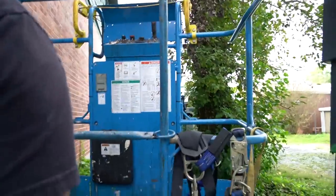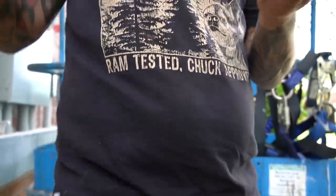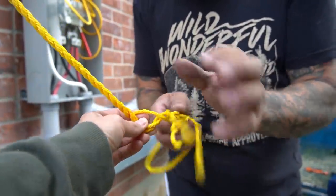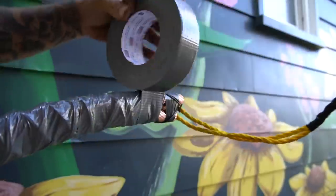On today's sketchy assignment, we try to pull a couple hundred pounds of wire from very high up all the way down here in a basket with a little tiny piece of rope. The sketchy thing is getting that lift next to that line — but it's not a high-voltage power line, so I'm safe. Round two. We're going to take all three of these legs, tie them and make a head, make it nice and neat and small. We're going to strip the insulation, make a tie-wire basket on it, tie it to a rope. You yank it on in — it should fit. We're maxed out on the pipe: three 600s into a three-inch pipe. It's going to be tight, but I've got the lift with the guns. She's going to yank, I'm going to push. Wish us luck.